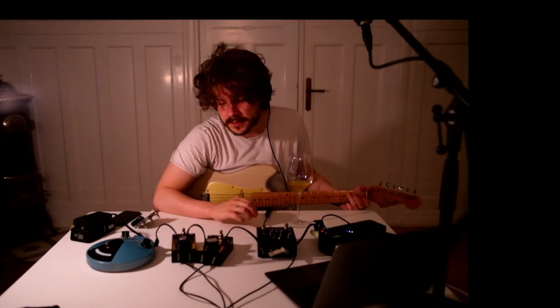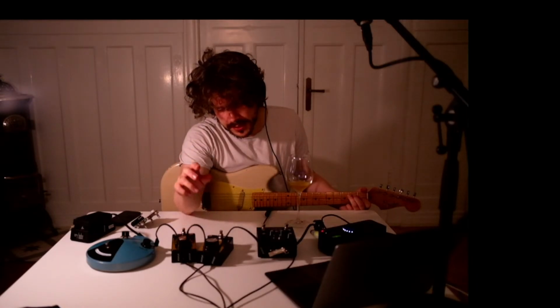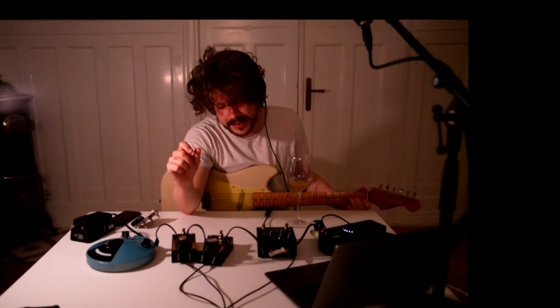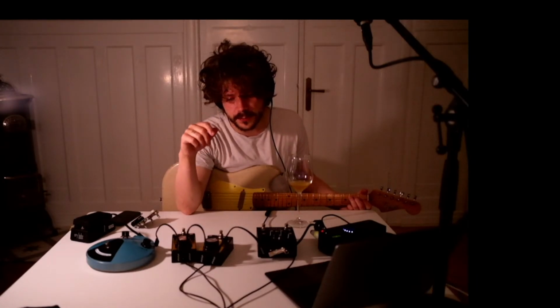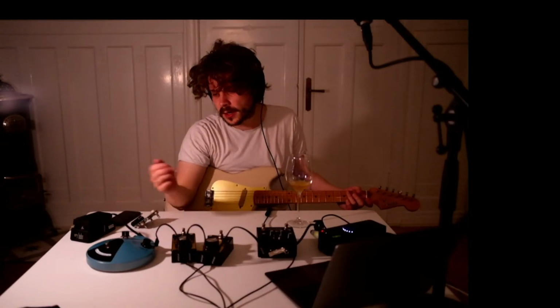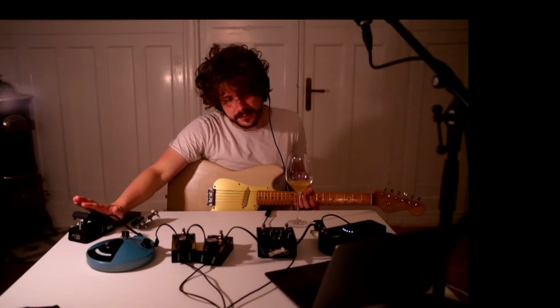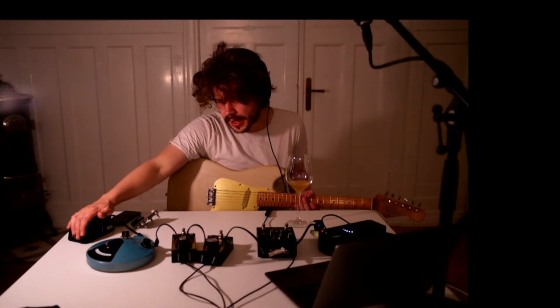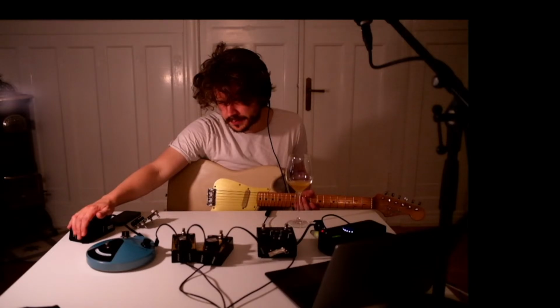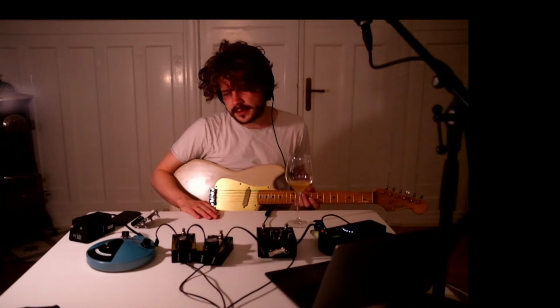And so for the version 1, I had a little push button that you could push and it would add a very simplistic gain stage in front of the fuzz that still was able to clean up quite well, which isn't something you usually find, because if you put a buffer in between the first phase and the wah, you can have it work. It sorts out the issue with the oscillation at the heel down position of the wah. However, you lose the ability to clean up your fuzz using the guitar's controls, right? And so I didn't want that.